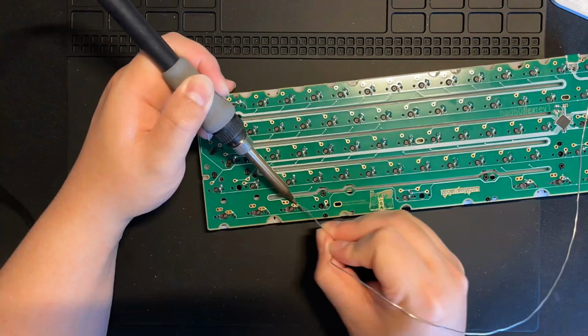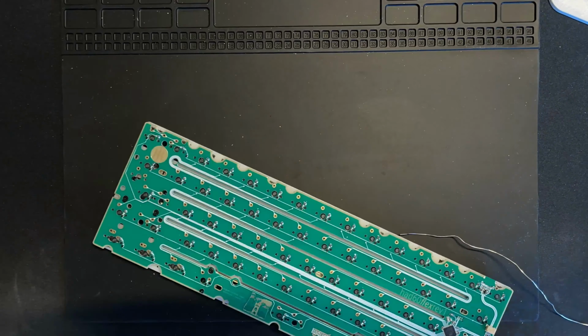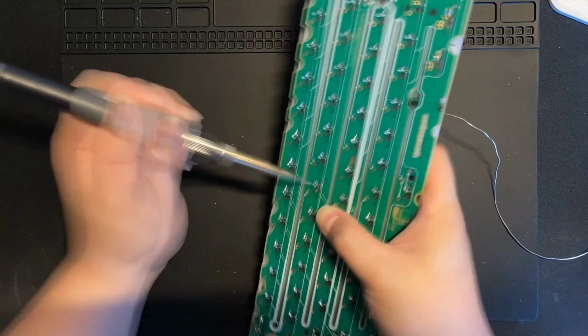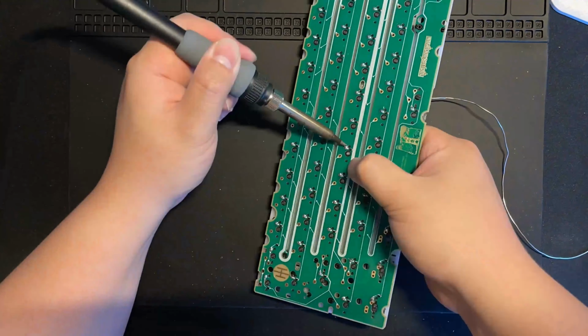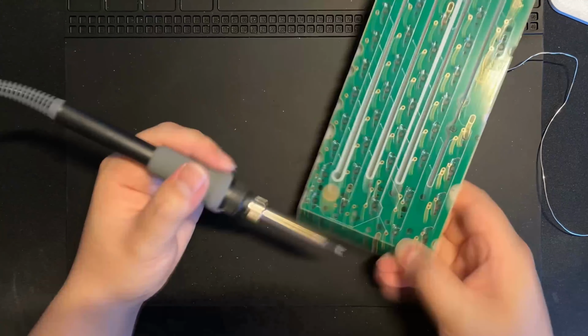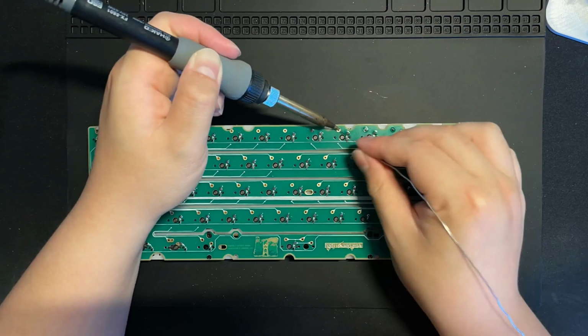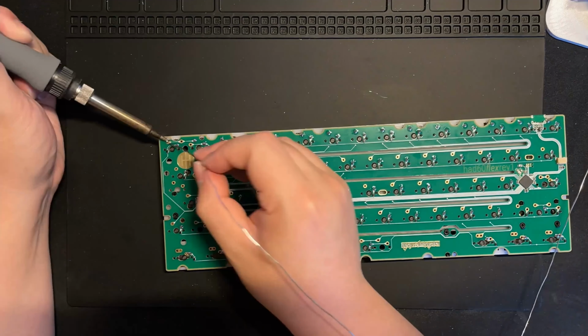In order to use the Holee method, first solder on the thick leg of the switch pin. This is the one closest to the center of the switch pole. Next, reheat your solder joint with your iron and push the switch into the PCB. And last, solder on the thin leg of the switch and ensure your solder joints are well made.